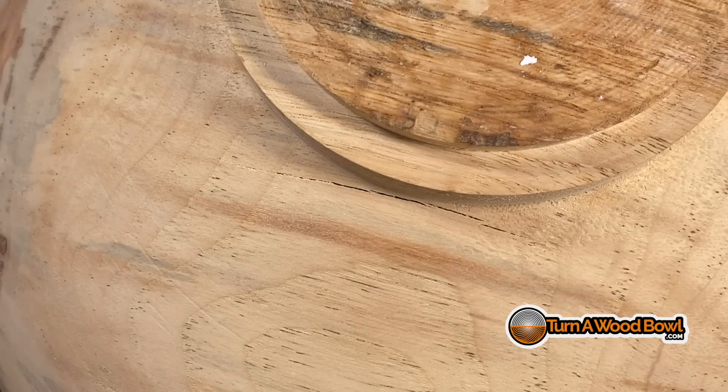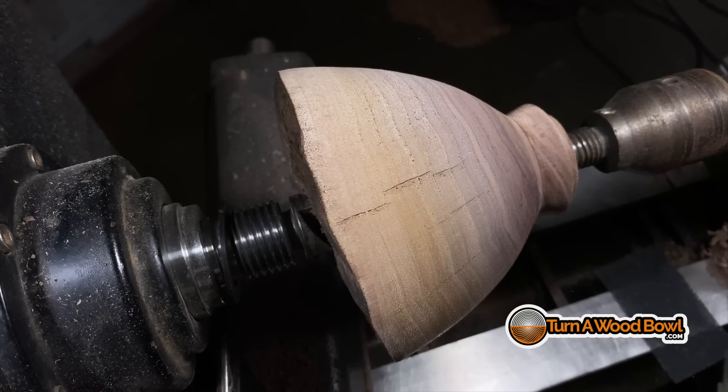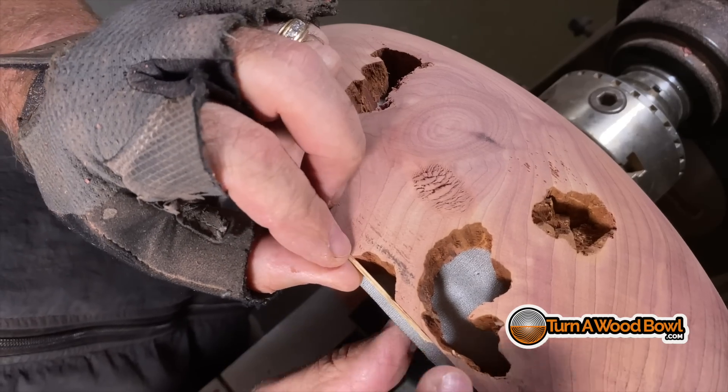All that being said, you're going to have cracks occasionally. There are different types of cracks. There are hairline cracks that are simply surface tension making very fine, thin cracks. They're usually not structural — they don't go all the way through the wood, they're more aesthetic, and they're pretty easy to fix. Sometimes we get larger cracks that you might be able to see light through. Occasionally wood has defects like a knot that fell out leaving a hole, or rot like in red cedar. Sometimes a crack on the surface of a bowl that moves with the grain looks interesting and it's actually pretty cool to leave those in and accept nature as it is.